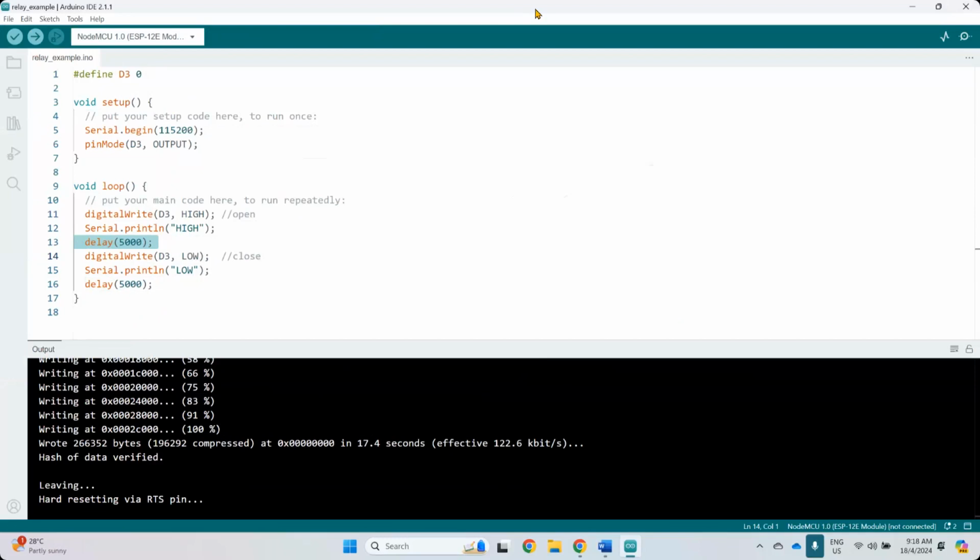So that's basically communication. It depends on the type of microcontroller, like the one that we have here. With the ESP32, you can set a higher, you can choose the higher bits per second. If you compile to ESP32, it is much, much faster compared to the 8266, which is slower because of the bits per second, the communication baud rate. So that's the thing with baud rate.